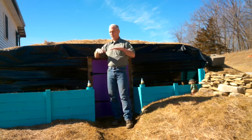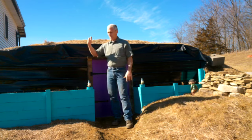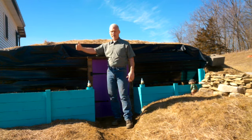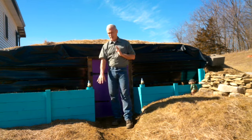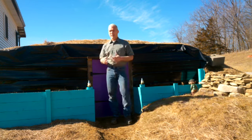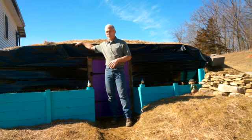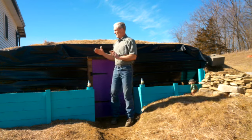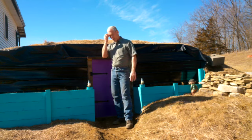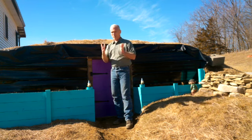All the way up is earth bags, then clean gravel, then the landscape fabric, then the wall. You stack them, tamp them flat, and every time I put a layer of earth bags, I backfilled between the wall and the earth bag with clean gravel. If any moisture tries to get through the wall to the earth bags, it'll hit that clean gravel and go all the way down and out. And if the ground were to shift, that clean gravel would keep the wall from pushing in on the earth bags — the gravel would shift enough that the earth bags would be untouched. This thing ought to last for generations.